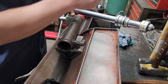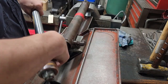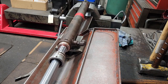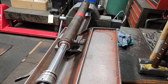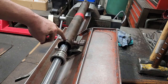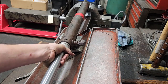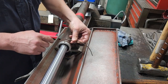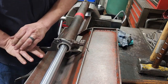Now we put it back together. Take the rod, put some grease on our piston seal and our O-ring, start our piston seal in — just hold steady pressure and start to walk it in. Our gland, where that wire goes in, has a hole that needs to line up with the slot in the tube — it's in position right there. Push, take our lock ring, put the hook in the hole in the gland, take our spanner, get that started, and then just turn that in.